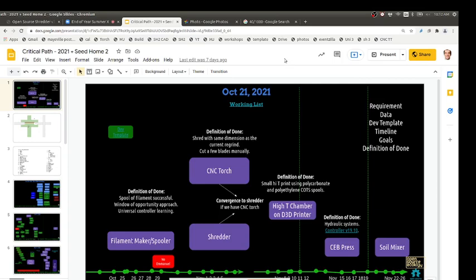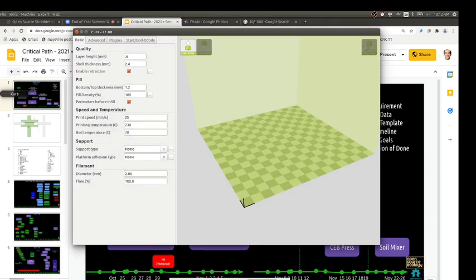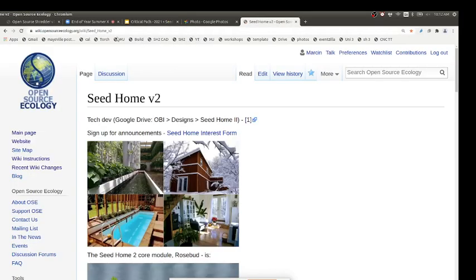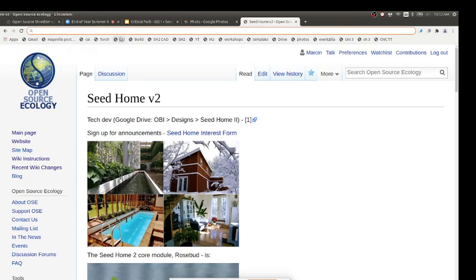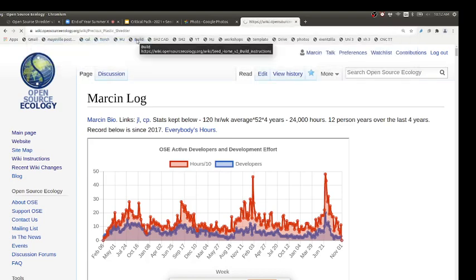You can hack it by using Cura. You've got your 3D STL and here's one hack: you go into zero infill. What does that do? It means no inside fill — it will only do the external contour. So if you want an easy way to generate cut files, take the shape and set zero infill. Let's actually show that using a shredder blade. Let's take a blade out of the precious plastic shredder design and see how it comes out in Cura. We're close to actually running some test files.